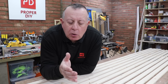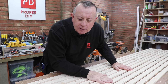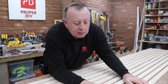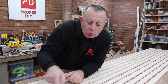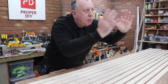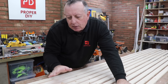I finally got through all the cutting, planing and sanding, and I now have 70 eight-foot-long strips of very smooth timber. Final dimensions are 38mm wide by 12.5mm deep, or about half an inch. I've laid some out here on the bench with some 18mm spacers in between, just made out of ply, because I'm trying to work out what size MDF board to cut to mount these on. I'm thinking about two foot wide or 600mm, but it does depend exactly on the spacing of these slats.